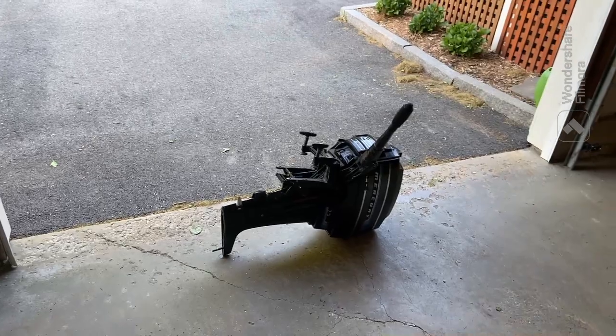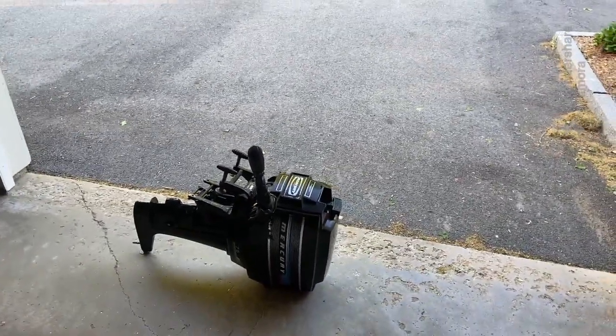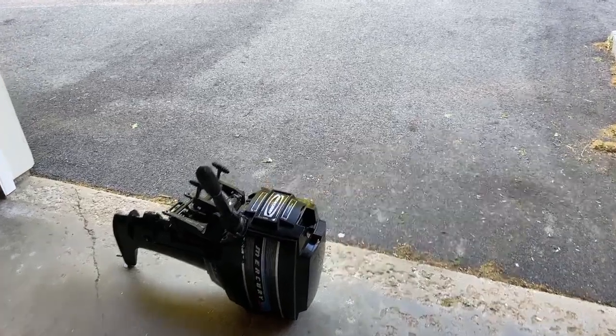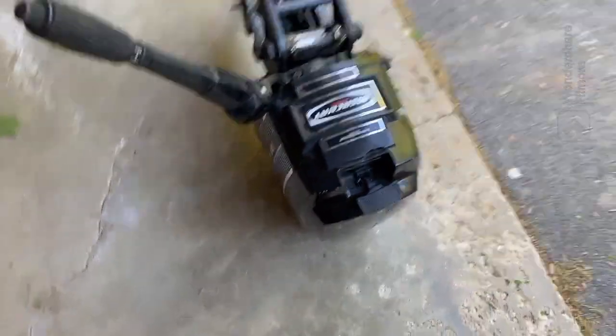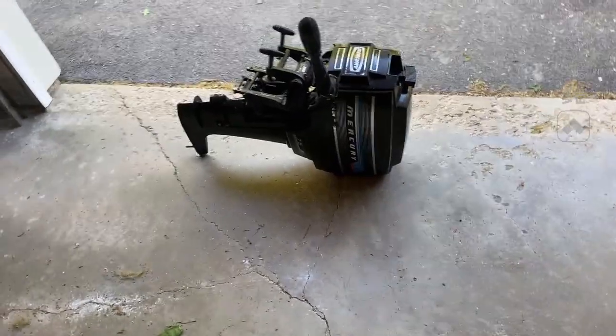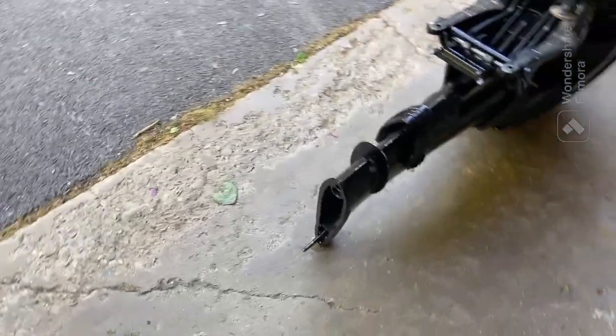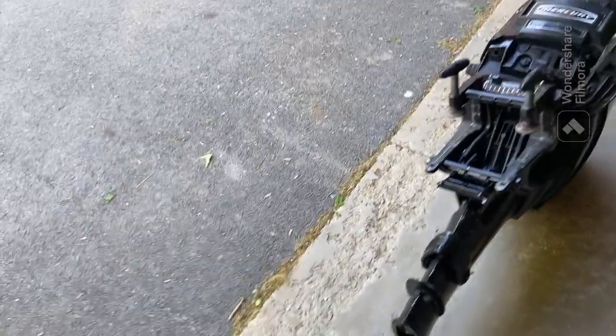It still doesn't run good, but that'll be in my next video. In this video, what I'm going to be focusing on is — I can't take the catwalk off right now because the thing is broken, but underneath there there's a ton of corroded wires that are all broken and I'm going to be replacing them. And if you're wondering why the lower unit is not on, it's because it wasn't pumping water and I needed to replace the impeller.